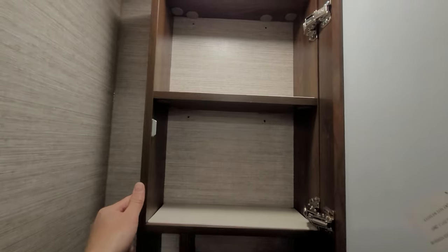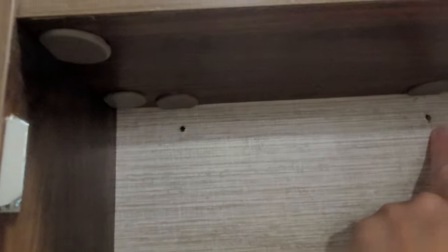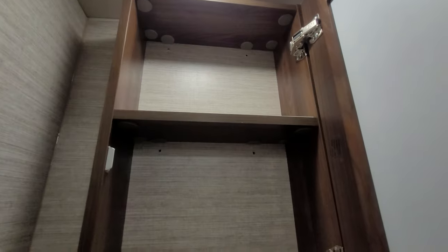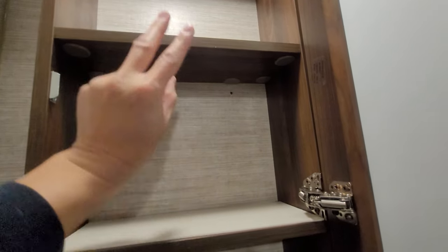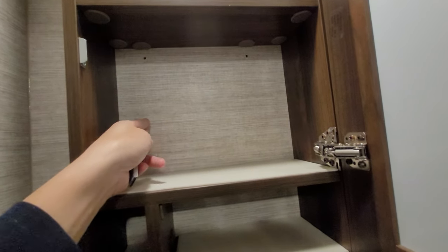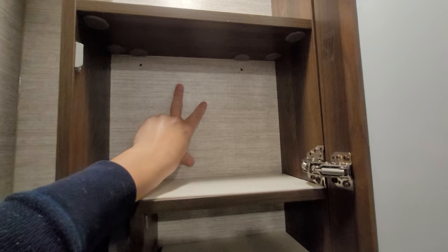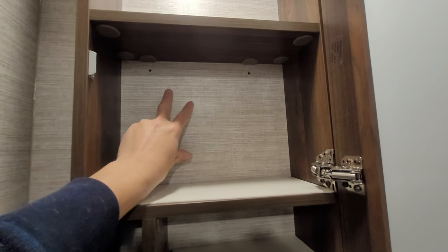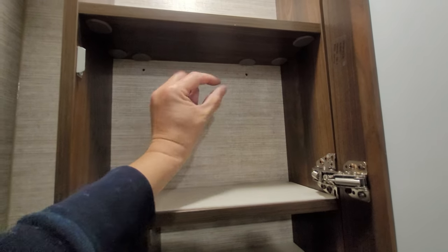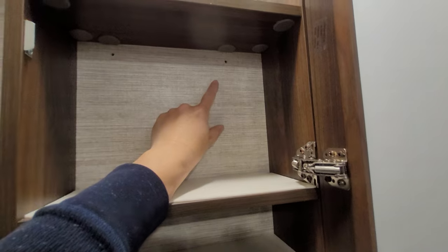In my bathroom I have one of these medicine cabinets, and after the first year my medicine cabinet started falling off the wall. If you look closely you're going to see the old screw holes here inside. So how Winnebago and many other RV manufacturers assemble their walls is — whenever they want to anchor something into the wall, they don't hit the metal studs. There are barely any metal studs. They glue a piece of metal onto the foam itself, and then this little piece with the wall covering on it — it's not plywood. It is 1/8 inch thick Luan, so technically not even plywood. It's so thin. So if you only attach a screw to the Luan it's not very strong at all.